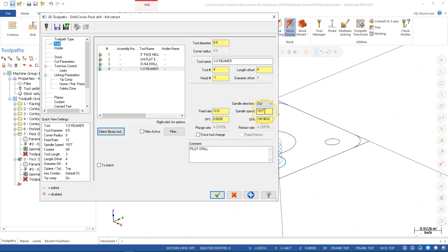All right, so half the speed, twice the feed would put us at about 800. And I don't know that I want to go right to 24, but I could see doing that at 20. All right, so we're going to get that tool loaded. The only downside is that we're going to have to make sure it gets plenty of coolant, plenty of lubrication.